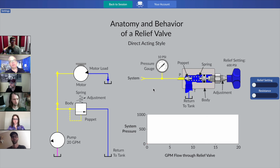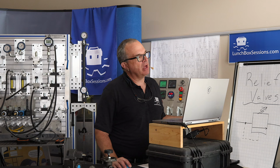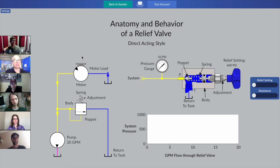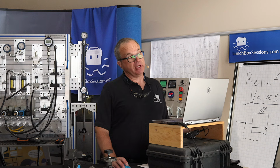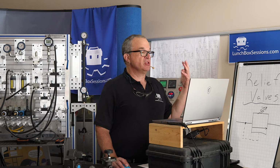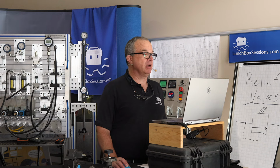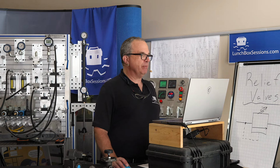And this time on top of our hydraulic motor, we've got a little platform there. What this platform does on top of the hydraulic motor is it's a brake shoe brick stacker platform. We're using the symbol for a hydraulic motor, which is the dark arrow pointed in. That way we don't have a cylinder getting to the end of stroke. And it's good to have a look at some hydraulic circuits where pressure needs to be limited, where there's something other than a hydraulic cylinder. So the hydraulic motor is the other very popular actuator to work with.